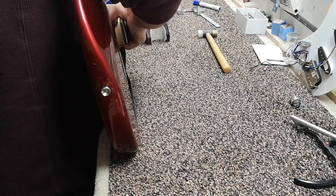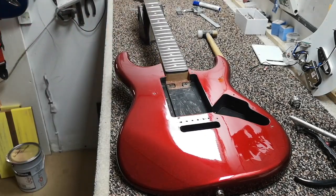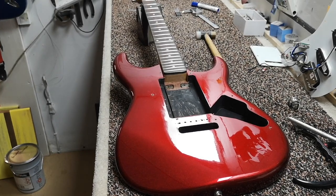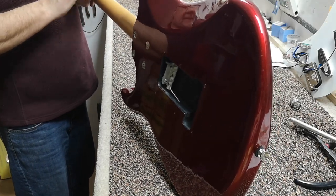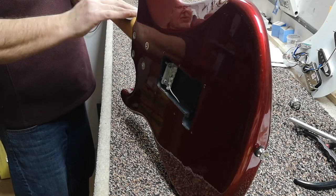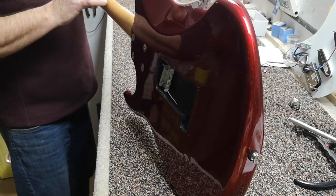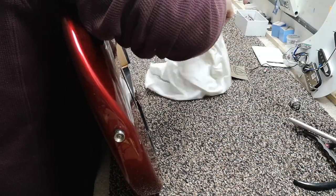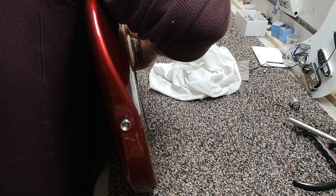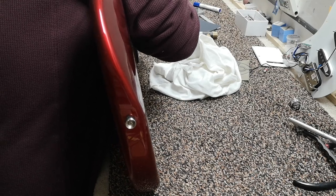And I think this fingerboard has been off before. Now, the only way to overcome that is to sand it down. And if we sand it down, then the only other thing we have to do is go back and slightly refinish, put some fresh poly onto the edge. Now this is slightly stained, so it's difficult to get rid of that lip without taking the colour away. In that case, you have to put on some tinted, and I can see it there, but it's an unpleasant little step, and I can see the glue that's under there. So it has definitely been off in the past. I don't think it's still loose or anything.